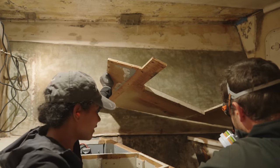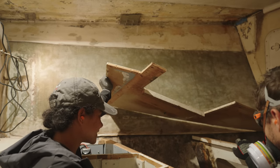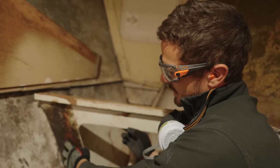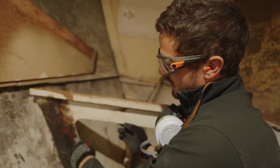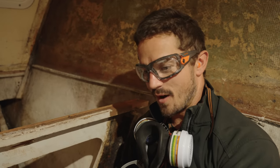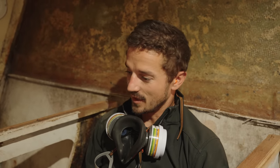Oh shit! Jesus! Remember how we said this fiberglass was a repair job that somebody before us did? We could tell it didn't do a very good job — they didn't mix the right resin or something. But then we took the top off, and that's the only thing that was holding it up. This is supposed to be part of the structural support for our bow, and it hasn't been doing anything for a very long time. It's insane. Pearson Invictus maybe, or older Pearsons — there are some good ones out there. By the time they started making these ones, they were just slapping production boats together. Our hull is like half a centimeter thick, and you can feel it flex while we're sailing.